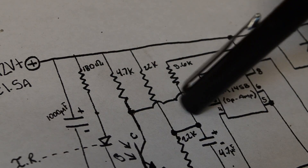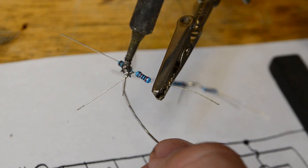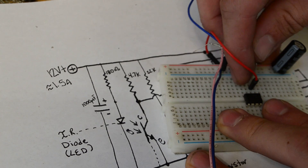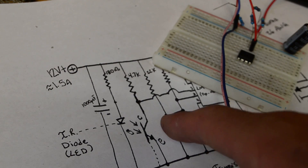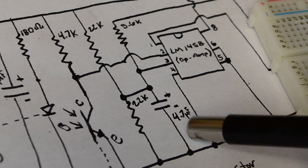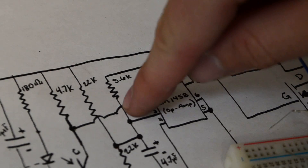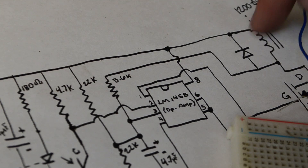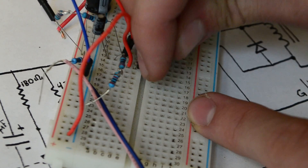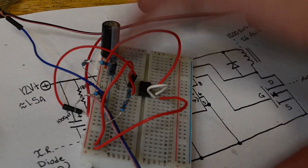Next, we need to connect a 22,000-ohm resistor going to pin 3 on the op-amp. Since I don't have a 22,000-ohm resistor, I took a 20,000-ohm resistor and a 2,000-ohm resistor and soldered them together — those two values add up to a total resistance of 22,000 ohms. We insert that into the positive rail and bring it over to pin 3. Then one more 22,000-ohm resistor goes from pin 3 to ground. On that same line, we connect a 4.7 µF capacitor with positive here and negative going to the ground rail. As for the 5.6k-ohm resistor, we'll come back to that as it needs to connect to the electromagnet coil we have yet to make. We can now connect a wire from pin 4 of the op-amp to the negative rail, connect pin 6 to pin 5, and pin 5 gets connected to the negative rail as well. Then a wire from pin 8 goes over to the positive rail.